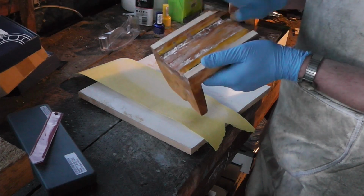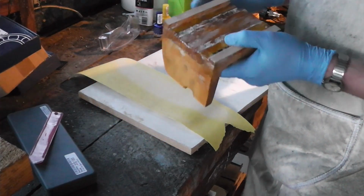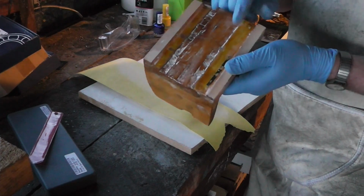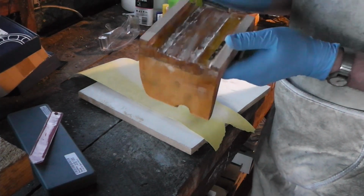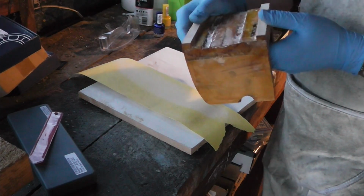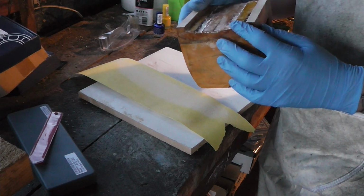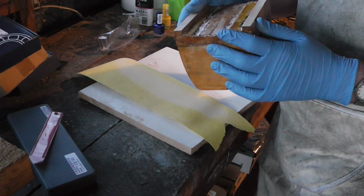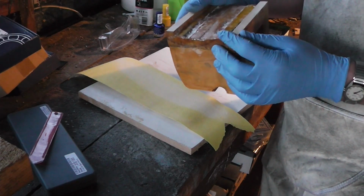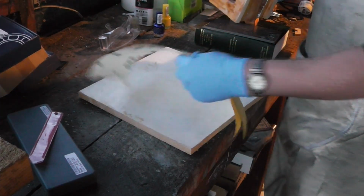When I mentioned on Discord about bringing this down to a 1/4 inch height here, someone pointed out that I'm going to get shrinkage. Well, the thing is, the wear pad's going to shrink as well, vertically. Not by much. Everything's going to shrink a little bit, but relative to each other, they're still going to be 1/4 inch deep. So I should be right.